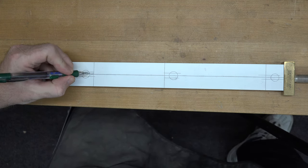Now it's time to prepare our stock to cut our train track pieces. We're going to be using half-inch thick maple. I have it cut to one and nine-sixteenths of an inch wide — the same width as our track and templates. The first thing we want to do to prepare the stock is take a one-sixteenth roundover and put a slight chamfer on each sharp corner. Nothing serious, just enough to take off that sharp edge. Remember, children are playing with this and we want to remove sharp edges so they don't cut themselves on the maple.